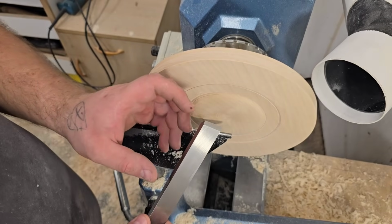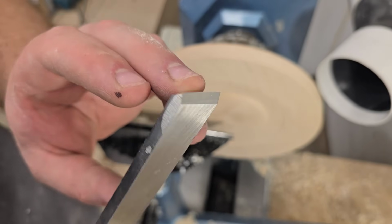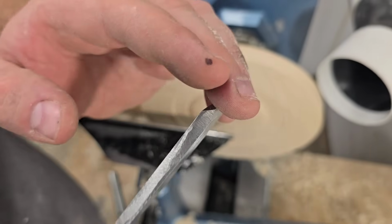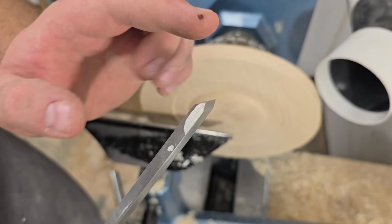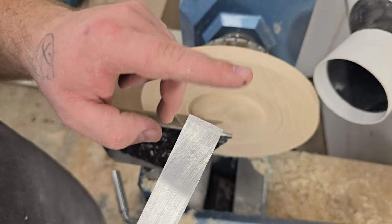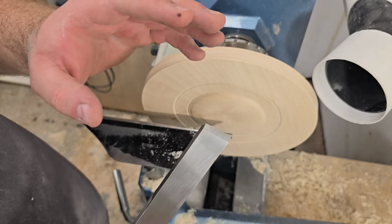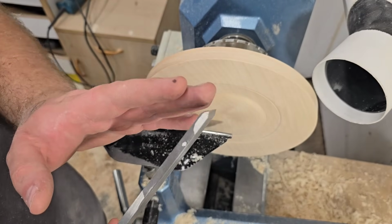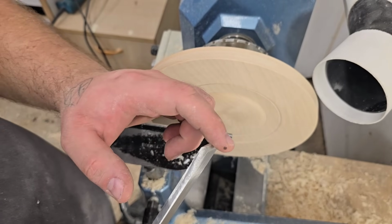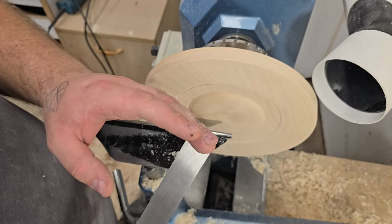Now, as I mentioned, the burr is when we sharpen, let's say in this case, this negative scraper, and we sharpen the bottom bevel last, it rolls the steel over itself like so. So it's sticking up like this. That's the burr. You're going to see it when I sharpen the scrapers on the grinder. You'll see that burr develop. Or we can burnish that burr, or roll it as I call it, with a burnisher. That way we roll a nice sharp edge into that sort of hook. That's doing all the work for us.